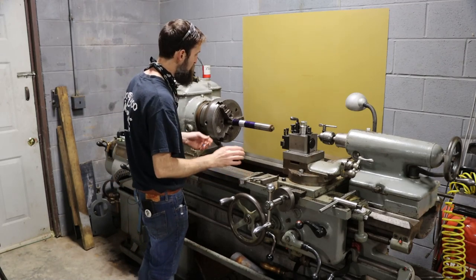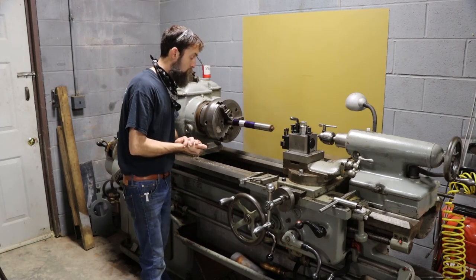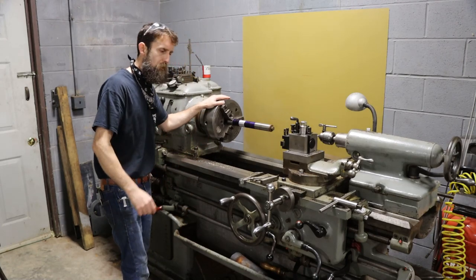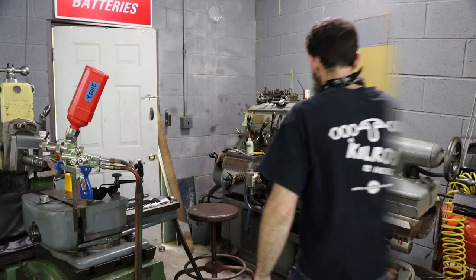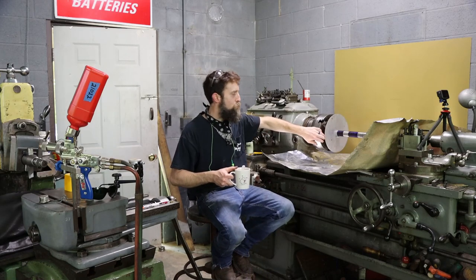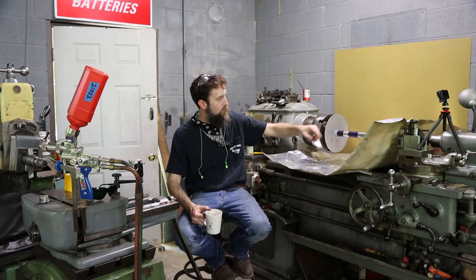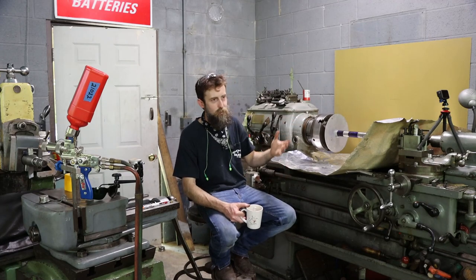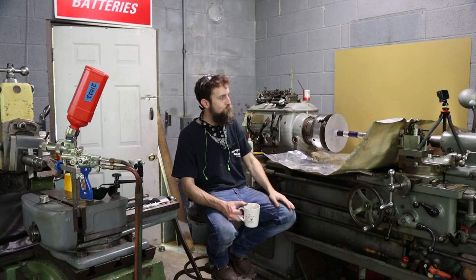That'll be handy. So let's cover up this lathe, shield it from the powder, and I think that's pretty much it. We'll be ready to rock. So I'm excited, kind of nervous as well. Never done this. So I'm pretty much ready to give this a shot. Put a little shield on there to guard the chuck from that spray. And a piece of aluminum over the bedways, and a piece of actually chalkboard. It's just the metal face of a chalkboard sitting behind the lathe to protect the wall.